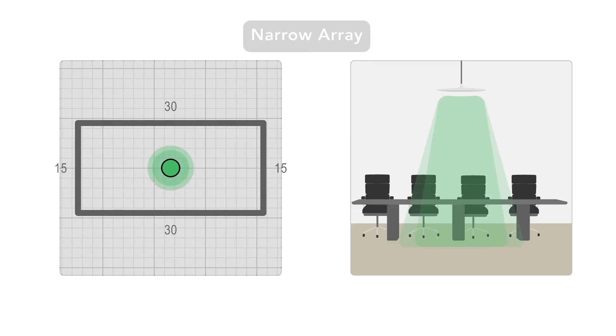Finally, we have narrow. The idea behind narrow is a bit different — we're literally covering only the person standing directly underneath the device. This is designed for situations like a podium speaker or any case where you want to make sure you don't pick up anybody not directly underneath. To install the STEM ceiling device, secure it to your ceiling, plug it into your Ethernet jack supporting PoE Plus or use a PoE Plus injector, and give it a couple of minutes to boot up, then move on to the platform to install the device in the room.